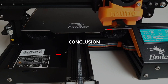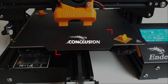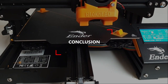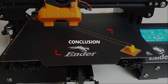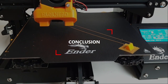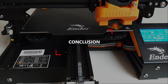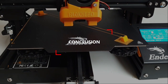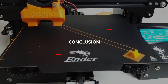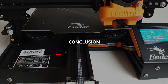Time for a conclusion. For most prints, the stock cooler is good enough and you may not need better cooling. However, the Blockhead provides several advantages: it improves overall print quality, it looks beautiful (though that's subjective), it improves visibility of the nozzle — especially important when printing the first layer or leveling the bed — it is easy and quick to print and requires no supports, and it is inexpensive, requiring only a fan for less than €10 or $10. The only drawback is fan noise at full speed, but operating at 50–75% still provides better cooling than the stock fan at a similar noise level. That's it for today — I hope you enjoyed this video and learned something useful. Thank you so much for watching. See you soon!